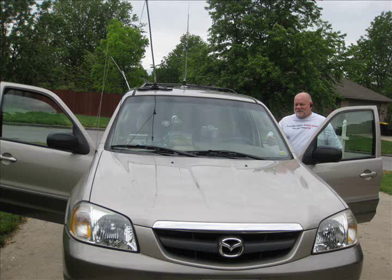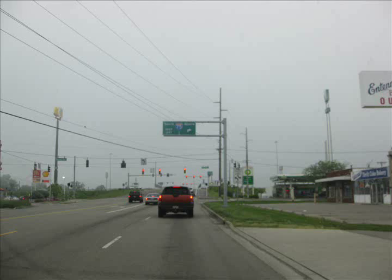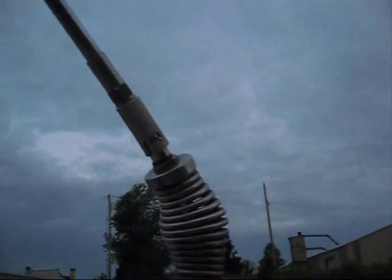This is a picture of the vehicle from the front. There are four antennas. On the passenger side you see the 30-meter Hustler antenna. In the back, what you can't see is the wire coming out from the Litz wire mounting, the mooring, which is on the passenger side back. As we travel down the road, the wire lifts at approximately 35 miles an hour and hovers about six to eight feet above the ground. There are a total of four antennas mounted on the vehicle.